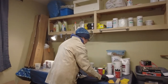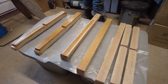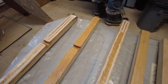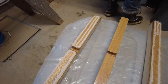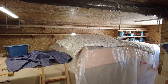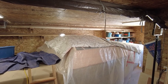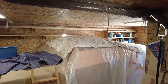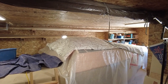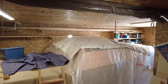I'm in the glue-up room with Mrs. Rover — she's mixing up some glue, put in a baggie. We're gluing these beautiful pieces of oak. There's an order they have to go in, then we spread the glue out. I've got the floor timbers in and I'm showing the steps I need to maintain the right temperature. I have two electric heaters inside, a tarp over the top of Wave Rover, plus heavy blankets on top to keep the heat in — and it's working. Despite minus 16 last night, it was a nice 15 degrees inside the boat.